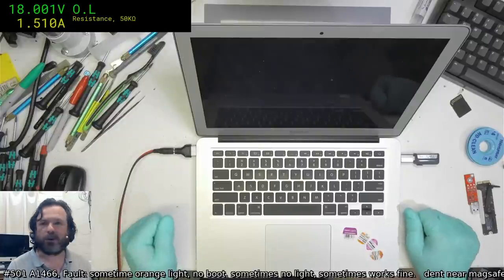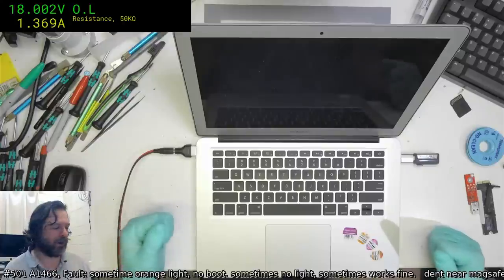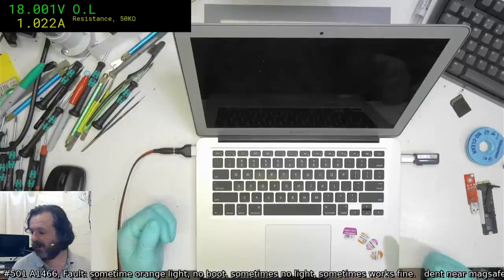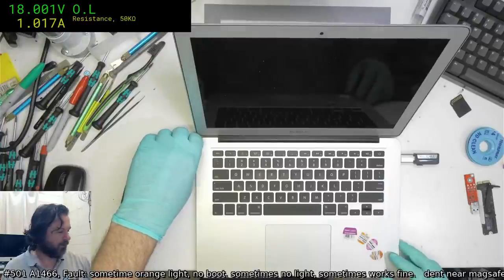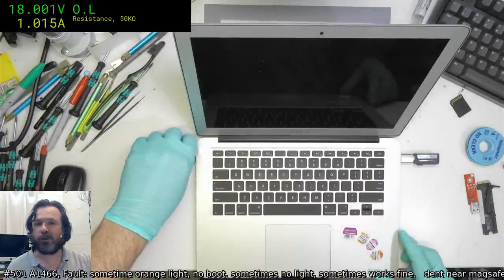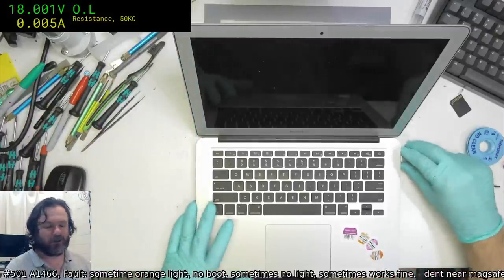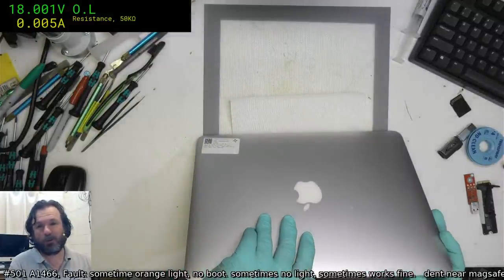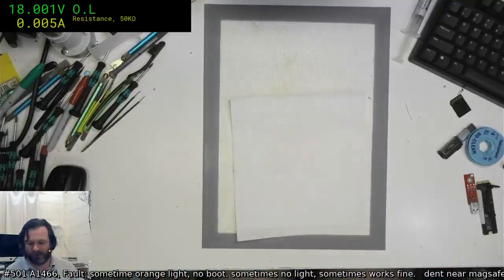You may think I'm mocking, but I'm not. There is probably about a 5% rate of boards going into the ultrasonic working and coming out not working. And sadly enough, a lot of them that come out not working, with the 165s, are the dreaded case where it will spin for 10 seconds, stop, and then keep spinning thereafter. And that's something I still have not found a fix for. I've got two boards here doing that, and I'm desperately trying to find out what's causing it. I'm hoping I can find a solution, because it does come up more often than I like.